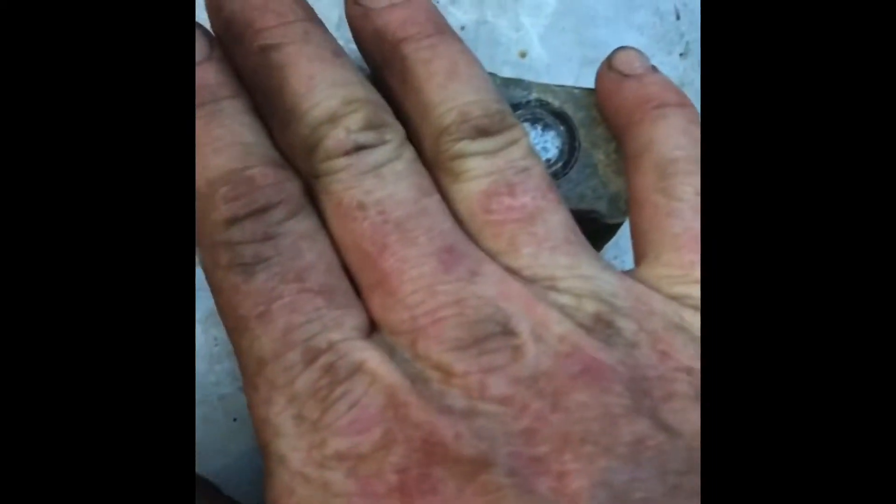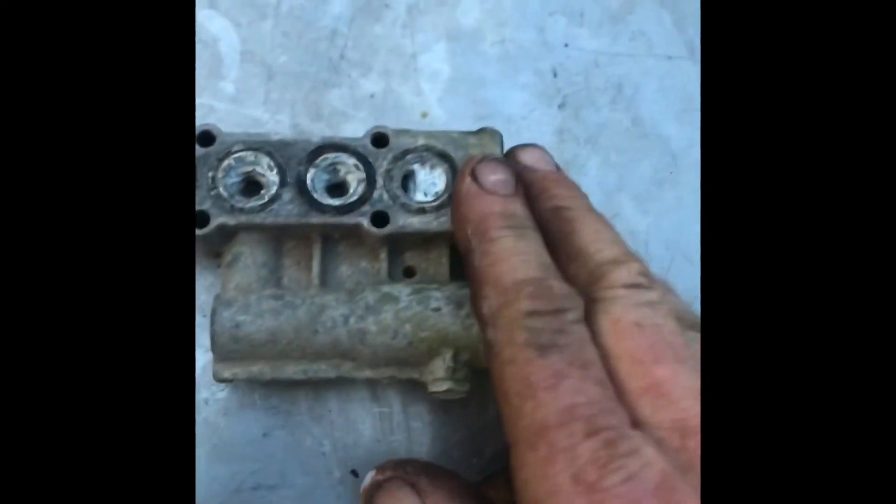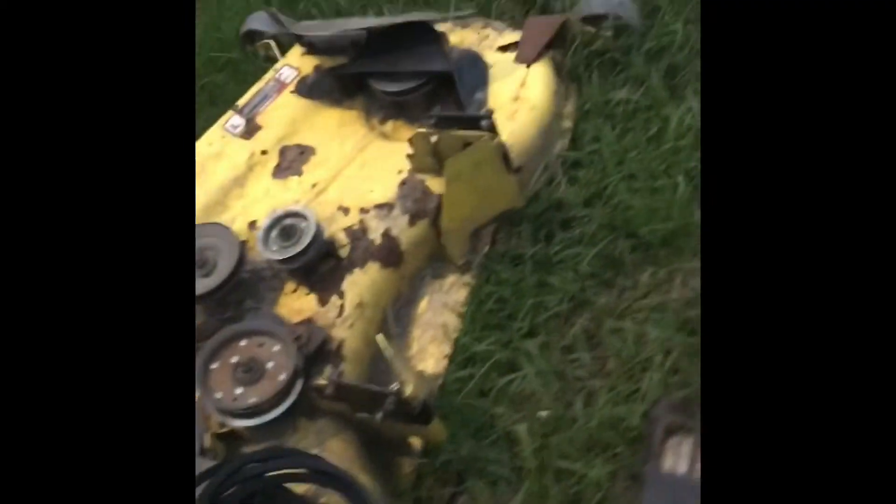I did find an O-ring that just sat right in there perfectly — it was a green O-ring from a green O-ring set that I had, and I put four of them in there. Then I bolted it back down and it actually worked. But I'm telling you, I spent a whole day on this pressure washer making everything work.